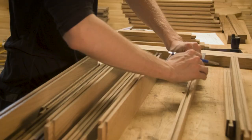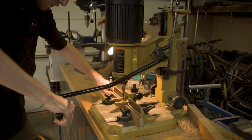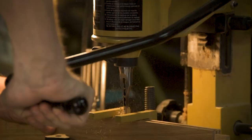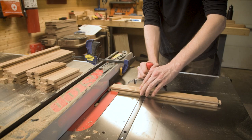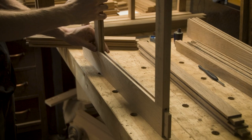Now again, I really like traditional style furniture, which is usually built very tough and very strong. So I started each case design with 4 solid 8/4 posts. This is going to be, again, a very strong design, and we're going to go mortise and tenon for all the joinery.